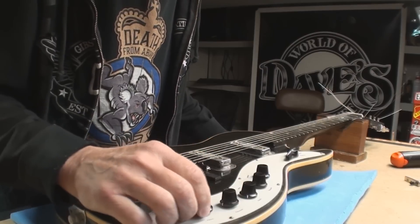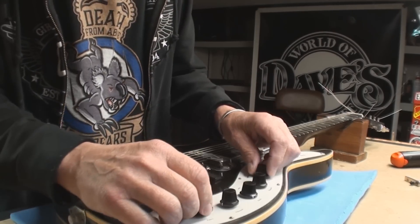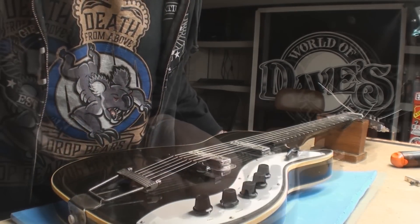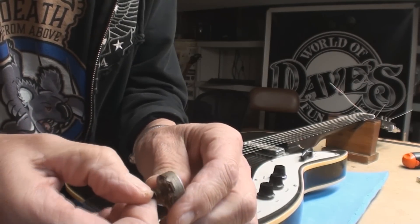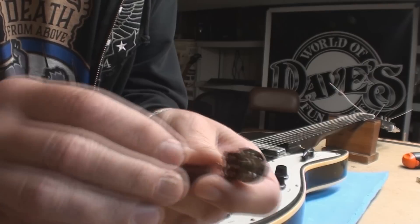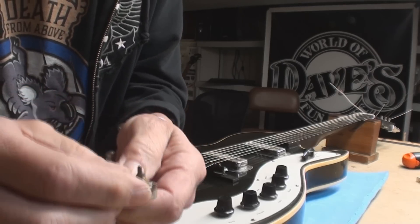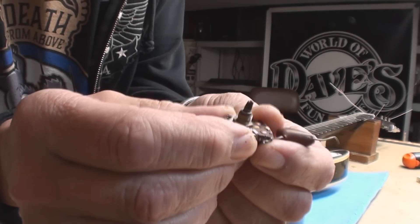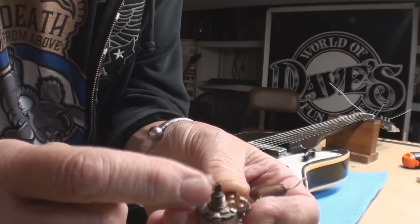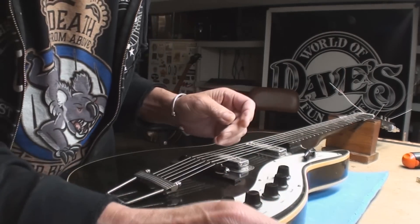Disclaimer. I think most of these are broken in some respect. You'll never find knobs like this ever again. This is an example of the type of potentiometer that is inside that guitar. You can see the tiny little skinny shaft, which gets compressed and bent over because that set screw gets over-tightened in the wrong spot. If we look really close, you can see it's got a split, but it's also got a flat side. So if you misalign that and you crank the screw, it breaks the shaft, and that's why those ended up getting glued back on.